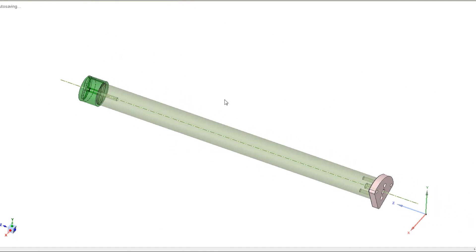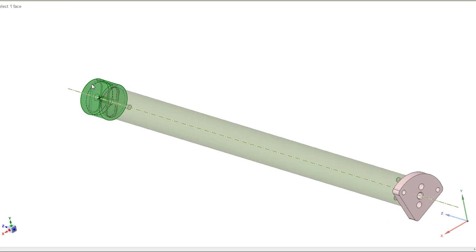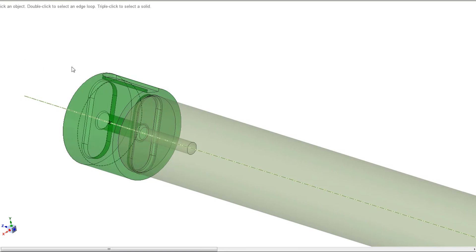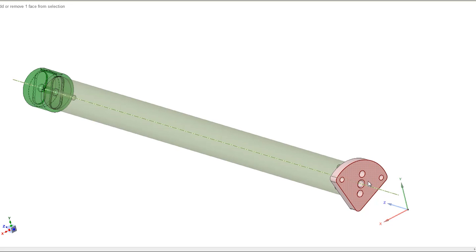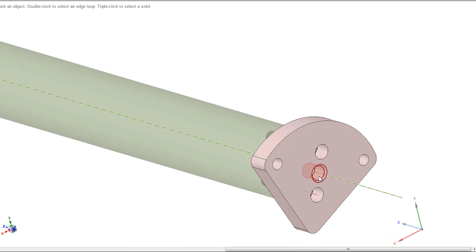The whole fixture looks like this — there's a piece of steel rod that supports this piece up in the bore. I've turned the OD so it'll have about four thousandths clearance on the ID of that hole so I can get it in and out of there, because there'll be a little bit of burrs after you drill the hole. I've also tapped a hole in the end of this piece so that I can put a slide hammer on it if I have to, to extract it out of the hole.